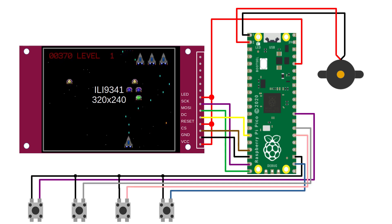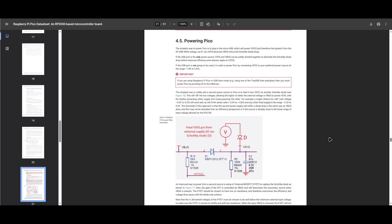I've used four buttons to control the game. If you've followed my previous projects, this circuit might look quite familiar — I've borrowed quite a few elements from earlier projects, and you can even run this game on the SSTV decoder. The Pi Pico is really easy to run from batteries; the datasheet shows a few different methods, and the simplest is just to connect a battery to VSYS through a diode.